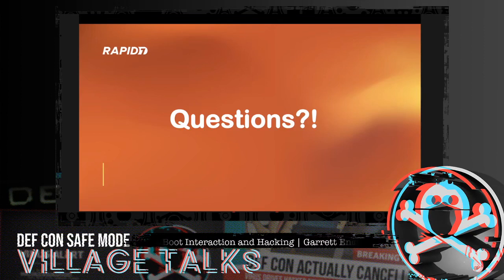Also, I've seen some where boot args and all of those settings are not even used by the kernel. That stuff is actually hard-coded into some kernel configurations. So alterations with boot args don't actually work, which can be problematic too when you're trying to carry out some level of attacks. That was based on that, I think what Garrett's going to demo here shortly will actually open up some other possible opportunities if you're able to break into the U-Boot console. Some of the stuff he's going to show may be very helpful in gaining a level of access into the system.